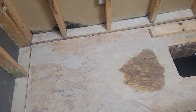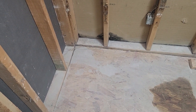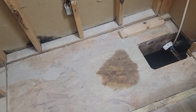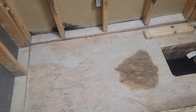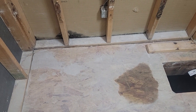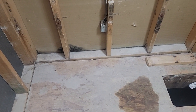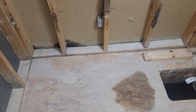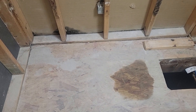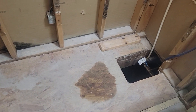I'll check to make sure it's level. This house is pretty rugged — the main carrier beam is right here and they're 2x10 floor joists. We've got two layers of plywood, so the old shower unit was in level, plumb, square. I think we're in good shape on this one. I'll open the boxes and bring in the parts. It's a caulkless type unit and it's mortarless, so we don't have to put any mortar on the base. It should be a fairly fast install — let's get started.